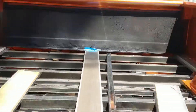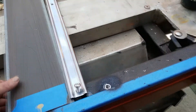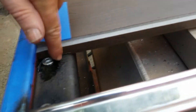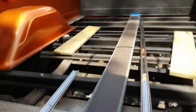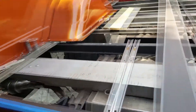Because the lip is a little lower, I had to mill the top out. I also wanted this board to be perfectly flat, so underneath I had to mill it as well, so you can see the lip under there — it stays flat and goes flush against everything else. Because these boards aren't going to go in the original holes, I found the center on the bed, the center on the board, and we're just going to work from the center out to the sides.